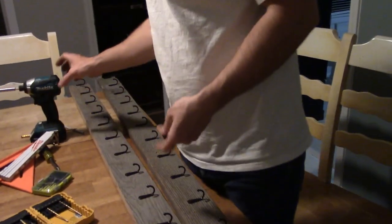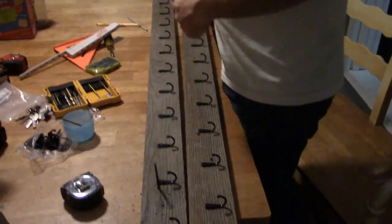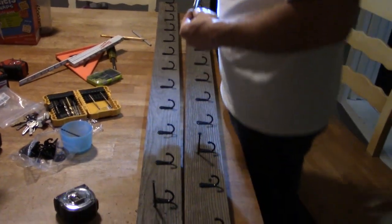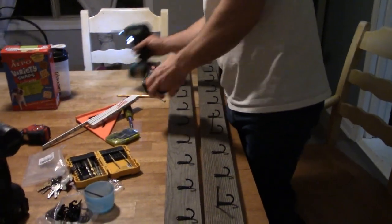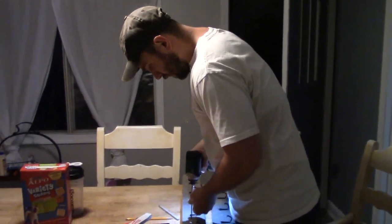Good. Because the barnwood is pretty heavy anyhow, so you definitely want to make sure you get into the stud for sure. And I really like how he taught me to countersink them, because that way you're not really seeing them, and it leaves a very flawless look to where you don't see the screw once it's in the wall. It's flush.